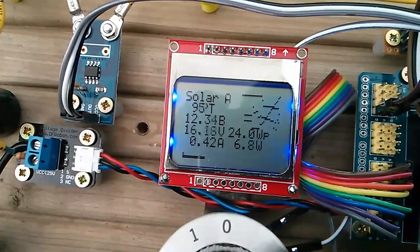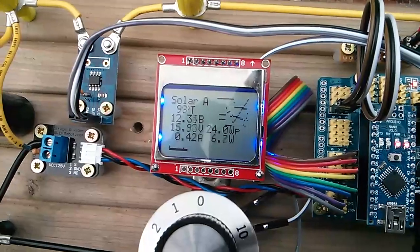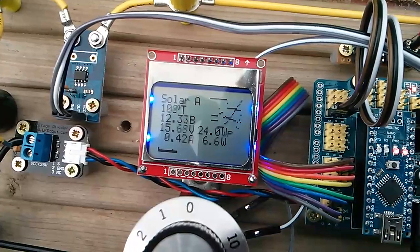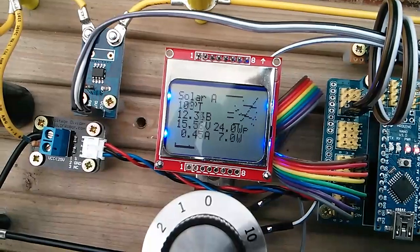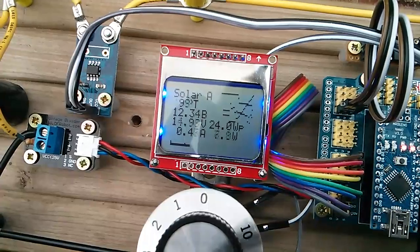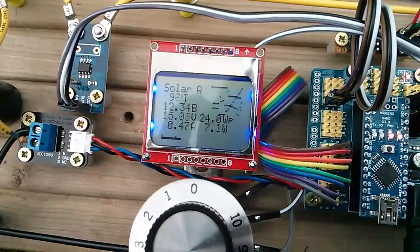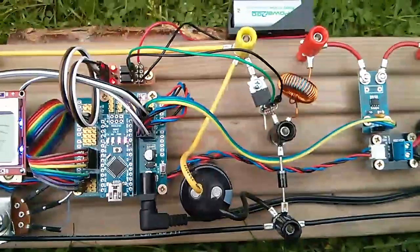It's still doing something — the sun's gone now. It's really not the day to be doing this, though maybe it works better in low light. Perhaps it wouldn't work at all if the sun was out — this is early days for the MPPT. I'm quite happy really, because it's tracking and not sitting against one of the end stops. It's finding a point which looks sensible, with the solar panel voltage higher than the battery voltage, so the buck converter is obviously doing some work.